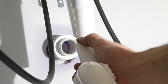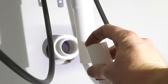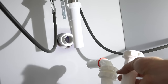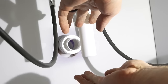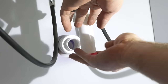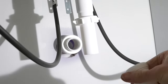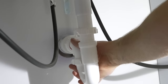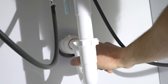After the cut, there are burrs around the edges and inside the hole, so I take my utility knife and deburr it thoroughly. Now that the end is deburred I install it back into the adapter, place the nut and washer over this piece — you might have to lift up on the sink to get it all in at once. Then it's as simple as tightening up all of the connections. Don't forget to tighten up this joint either.